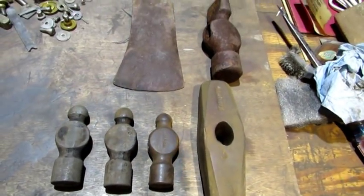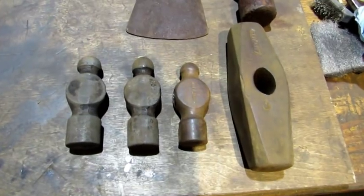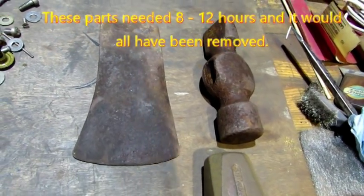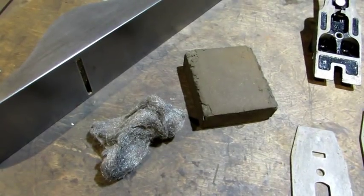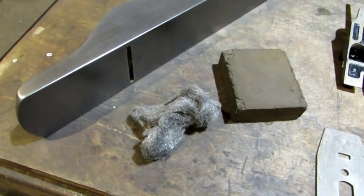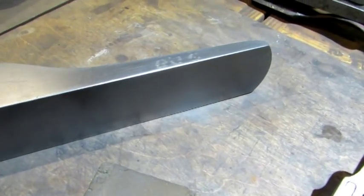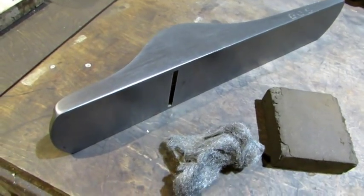Now the hammers and the hatchet — those four pieces right there came out really good. But those other two in the back would have to spend probably another few hours to get all the rust off. But you can see the marked difference in what we've got right here. And to finish this demonstration out, I took an old worn sanding sponge — you can see there on the right — and some 3-0 steel wool, and about two minutes of work. And there's what the bottom of the plane looks like, about ready to put some dirty oil on and put it back together.